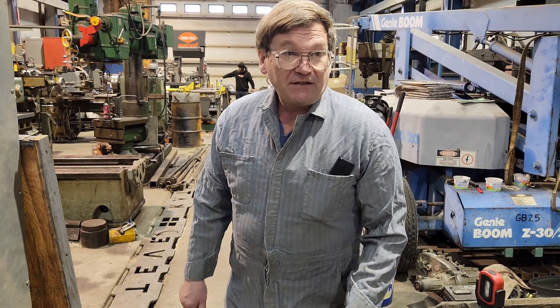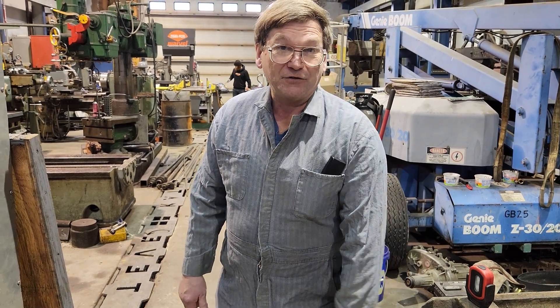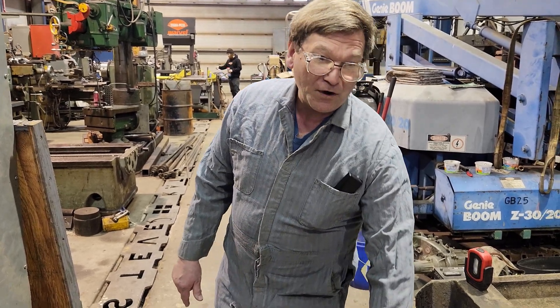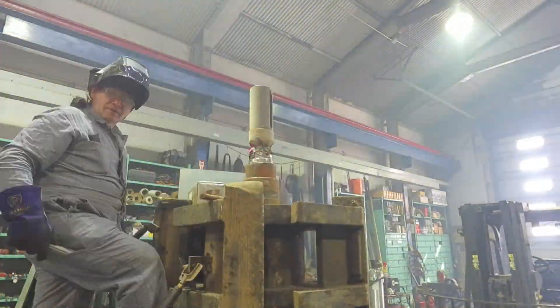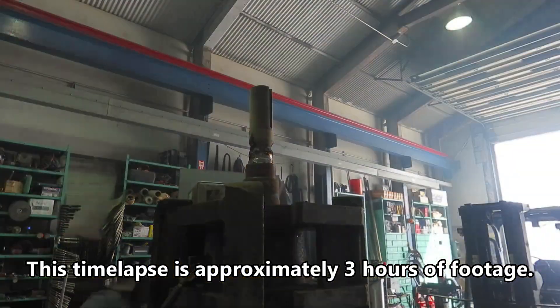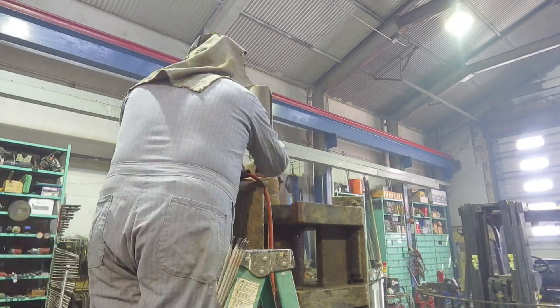With the stick, you can work slow. You can get 100% of the quality of your metal. As a machinist, you learn more about getting an x-ray quality weld than most welders ever do, because after you weld this carefully and turn it back down, you will see anytime you had a pit in there, layer by layer, as you turn it back down. You have to get into the bead puddle — the actual puddle has got to be clean 100% of the time while you're welding up something like this, so that when you turn it back, it's all good metal.